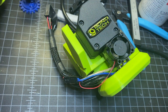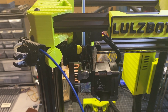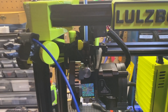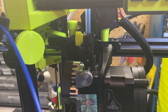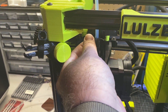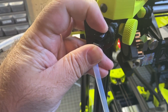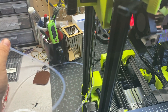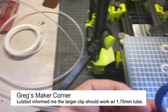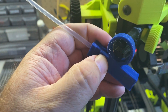Let's see how it goes on. The first thing I'm going to do is preheat to PLA and then remove the filament on the current tool head. There's a handy option for change filament — you can just do unload filament. It's going to raise the gantry and then retract the filament. Now I'm going to remove the Bowden tube by loosening and squeezing to release it. I also designed a custom clip based on the 3.8 millimeter design — the tube sticks in and filament feeds through, clipping on just like the original.